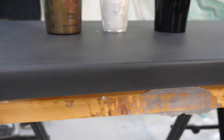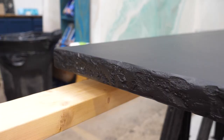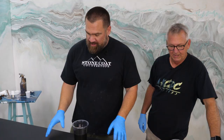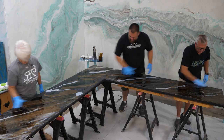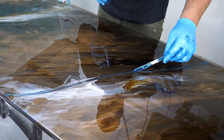We're mixed up. Let's get out there next to Rhonda onto our project and start applying some epoxy. So we've already pre-mixed our colors into the resin and divided those up into individual cups. We're going to pour this out randomly — we'll each grab a cup, get all the material out on the project, spread it with our hands, get any surface tension out, make that board all the way wet. Then we're going to mix up our accent color and bring this project to the next level.